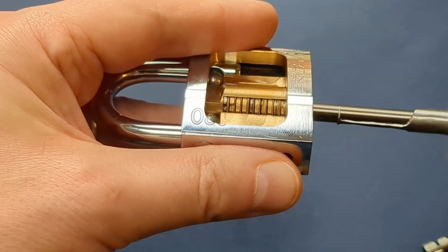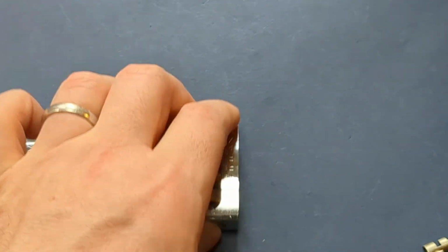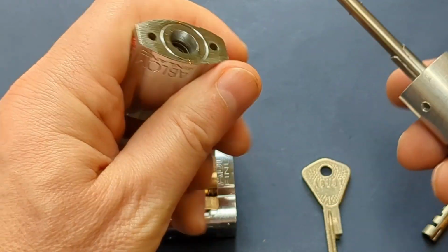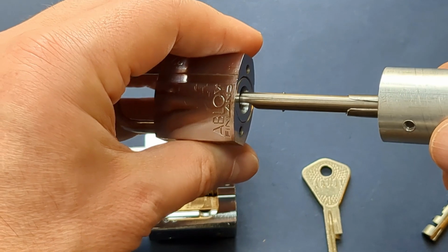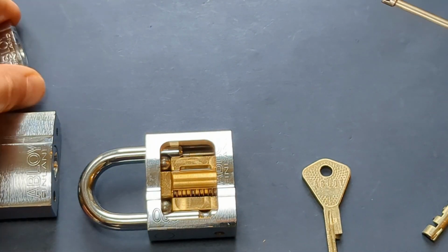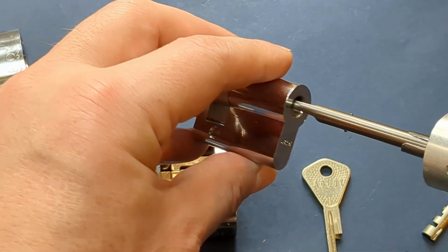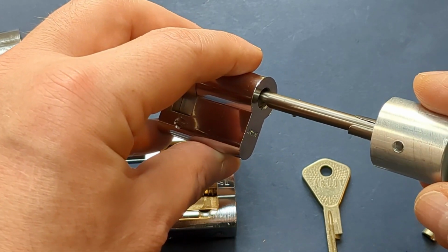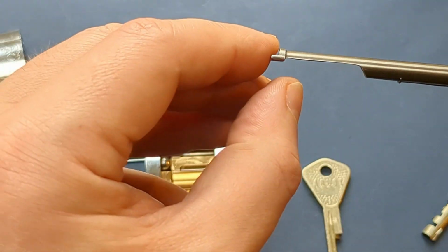you can see there it's turned the last two discs, but that will also work on a lock like this with right-hand warding, sorry, left-hand warding, and a right-hand tooth plate there. That will go all the way to the back of there, no trouble. And of course, locks like this, same front plate warding, but it's got that central tooth at the back, so it will go all the way into there. So there's some fairly subtle things on here.